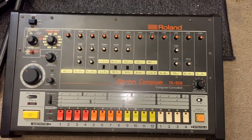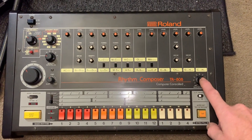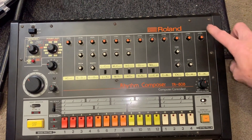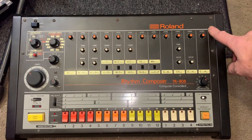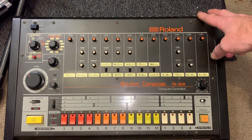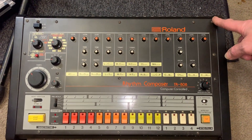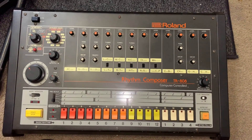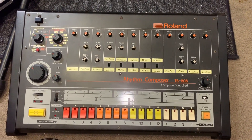The 808's all back together. To round it off, the things that were wrong: the master fader was really dirty, so I cleaned that out. There was also a pinched cable in the loom going to the output board — one of the wires had broken off and been re-soldered, but was still bare and exposed, causing a short, which made it intermittently work. The output jacks were also very loose, so I bent the tip prong inside each jack to make them tighter and cleaned them with DeOxit. Then cleaned all the switches, knobs, and pots, and did a calibration as per the manual. It should be all good.